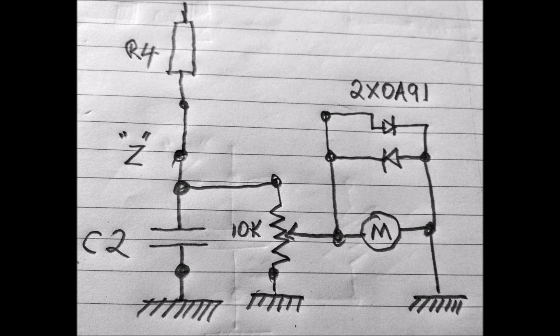I made two modifications to the original circuit as per the schematic. First, I put two germanium diodes back to back across the meter movement to give it some protection. I also found that the adjustment of the meter movement on full scale deflection was not very linear, so instead of having the variable resistor in series with the meter, I set it up with a voltage divider with the meter in the centre, which is much more linear and much more satisfactory.